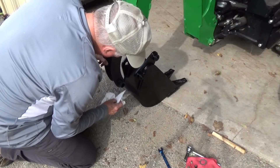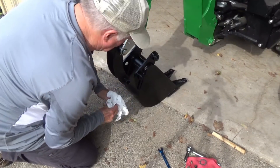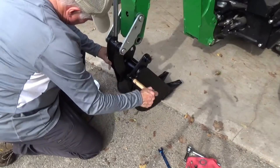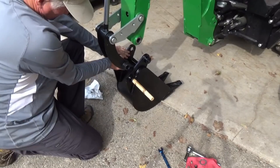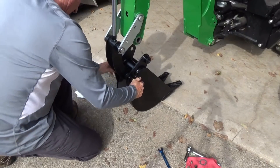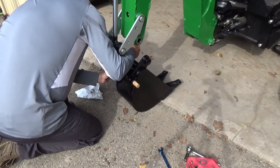I took the opportunity to clean off some grime, cleaned all that up. I'm going to give it a fresh grease here when I get it back together. The dowel worked out real well just to temporarily hold the bucket. Now at this point, I'm thinking I need another person. Well, it takes me a while sometimes to figure things out — then it dawned on me, why not lower the dipper stick down to the bucket?